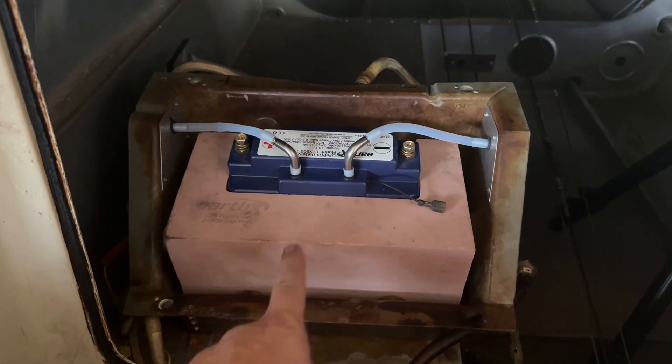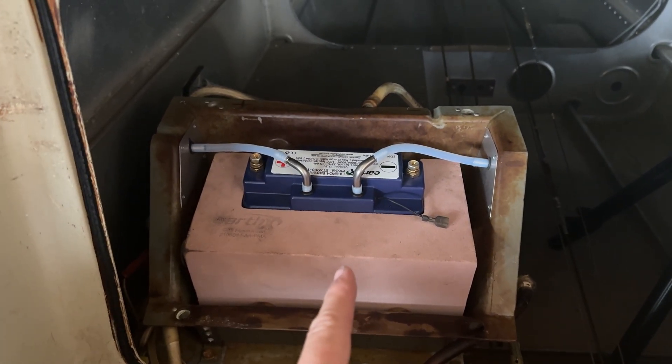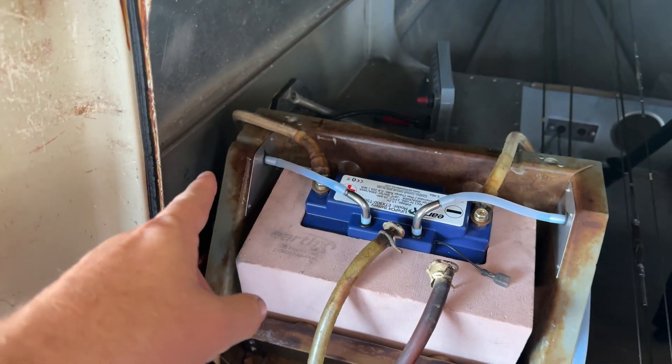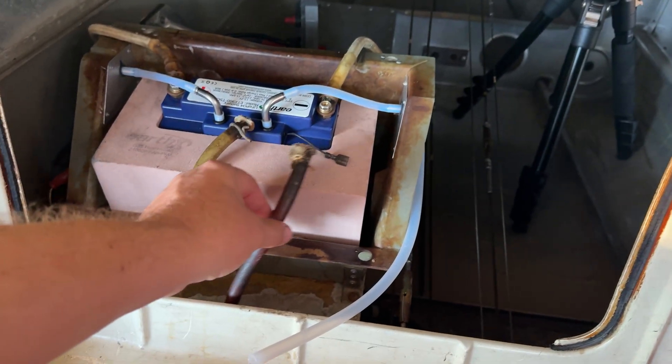Editing Carl here — I don't want you guys to get confused. I ended up repairing the box and then forgot to record when I started adding tubing to the top of it, so you're going to miss some stuff. All right, so this is looking great. We have all of our tubes and things in and I'm happy with the result. Took a little bit of finagling to get there. Let's hook these leads up. So now all that we have left is to run these vent lines. The old ones are pretty messed up, so the plan is to take this one back and around and then come forward, and then they're going to tee together right down here. The vent tubes will route to the aftermost tube vent because of the way the system works.